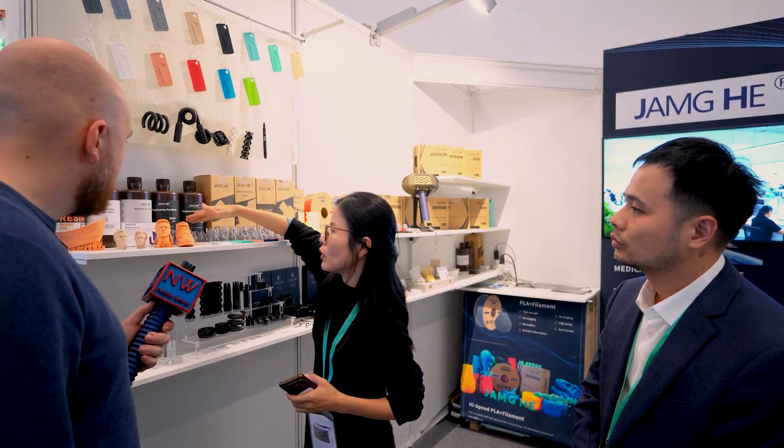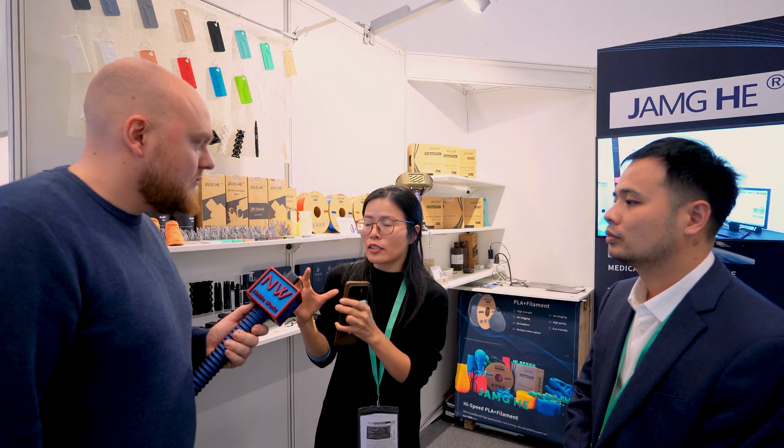They are really tough but not that strong — it's like a standard resin. The high hardness can be 88D or even 90D, which is very high hardness, but it's really brittle. Once you drop it on the floor, it breaks. So we have something in the middle — high enough hardness but also flexible. That is the Engineering Pro, which is durable, meaning it keeps its shape.